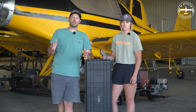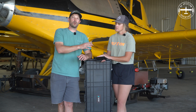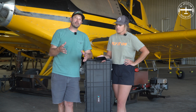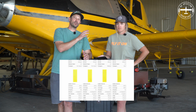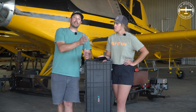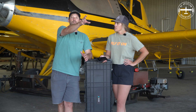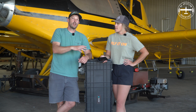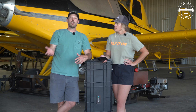After you take the photos of all of the cards, they're stored in the app. When you look at a test, besides information like your gallons per acre, volume mean diameter, swath width, and exactly what your pattern looks like — where it's heavy, where it's light — at the bottom you can scroll through and see every card that you sprayed. It tells you at what increment in feet that card was at. So I can look 15 feet out and actually see that card like we had it out there when I sprayed it. I can see exactly what my droplets look like on every card, and it's there forever. We ran one of these last year and we can go back and see if anything has changed.